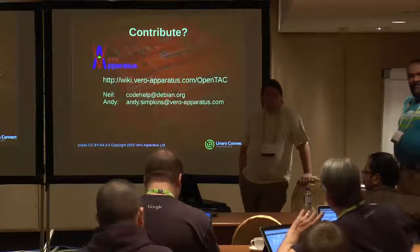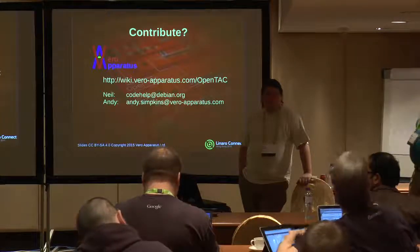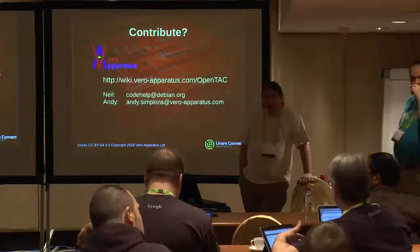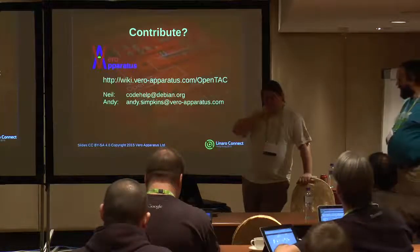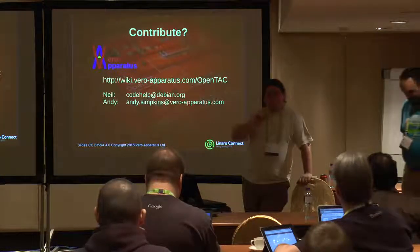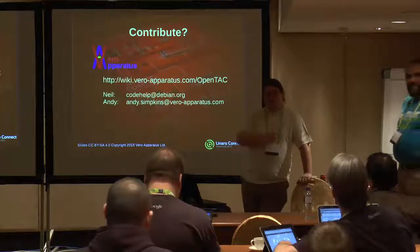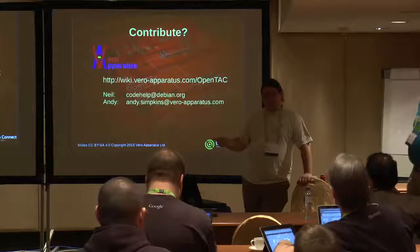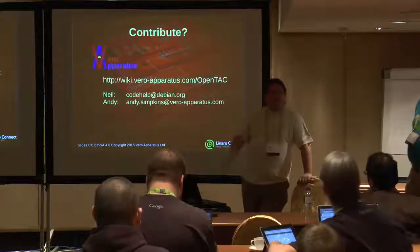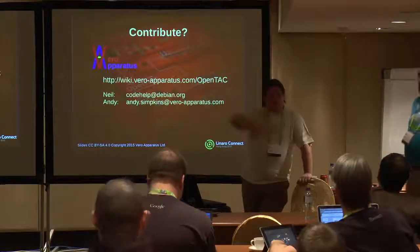But for a production environment, I've now got to be convinced a lot more of the reliability of things like USB serial, because I have been playing with USB serial for a long time. So coming back to the USB serial, let's have a few niceties on here. If we break the connection to our host, we don't drop the USB serial. No, it's usually kernel issues. Yeah. It's not the hardware. No. But there are also a few other issues with that, so I thought I'd just mention it.